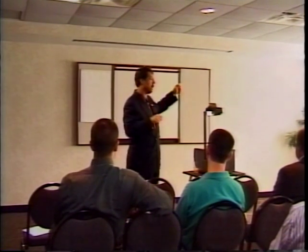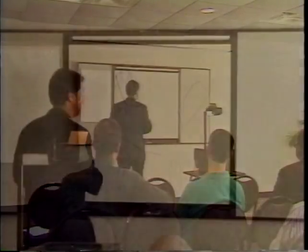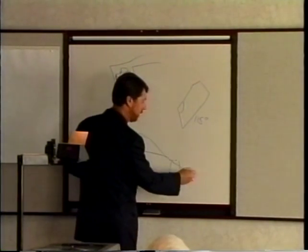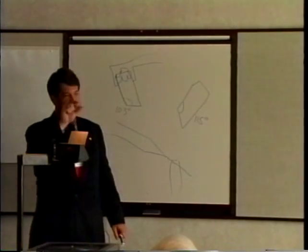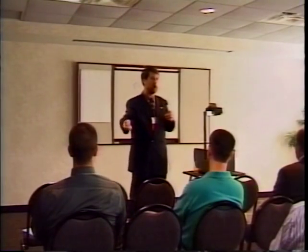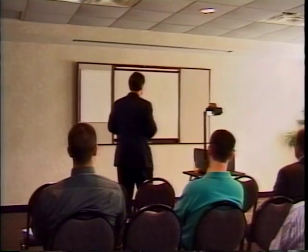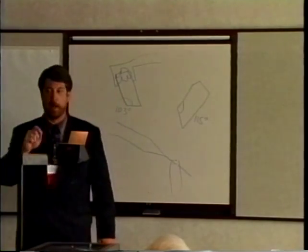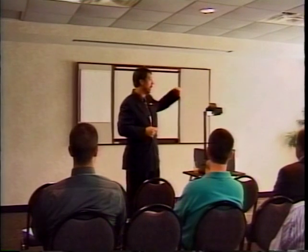pull it out. And as you pull it out, it cools off, and eventually it'll break off, and you'll have a string, just a long string of shellac hanging there. Then you can look at that, and it's going to be tapered, because it's going to be thicker while it's up at the point and very narrow where it finally separates from the hot shellac. And you can come back with your tweezers, and you can snap that off where you think you have the right amount or the right thickness of shellac. So then you take your pallet fork and you warm it up.